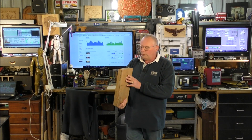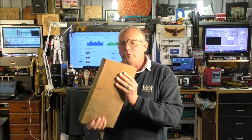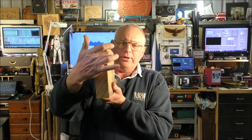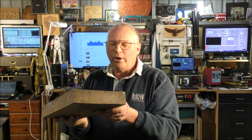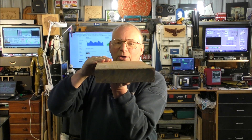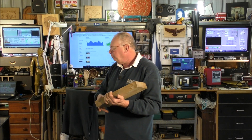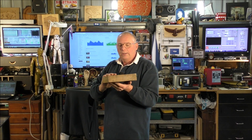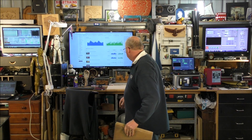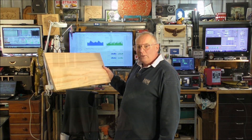Today I'm going to take this piece of oak plank. You'll notice it's cupped here, flat-ish here, and fairly straight, but on the flat side it's slightly twisted. I'm going to set this up in my 6012 CNC router and flatten that surface first, then laminate it to this piece of Tasmanian pine.